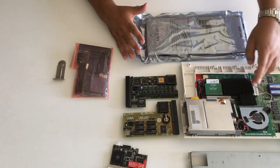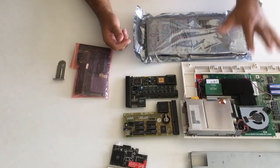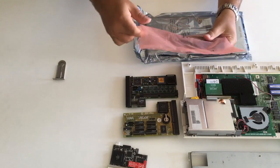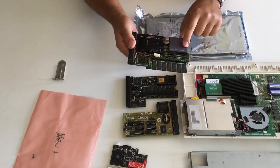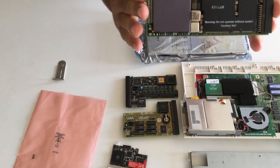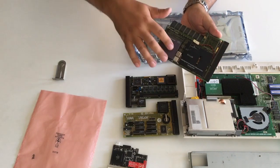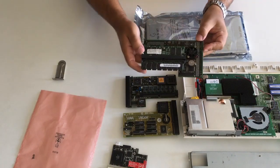The way we're going to test these is actually not with my Warp card, because Caesar and Andre soldered the 68060 for me there, so I'm not going to remove that. We're going to test these CPUs through this little Amiga 1200 expansion card that has a 68060 CPU. It says 68060 RC 50 megahertz, but if we take a closer look, it has this little code — and that says it is revision 5. So this one is going to be pulled out, because we want to use the revision 6.